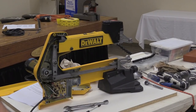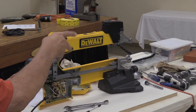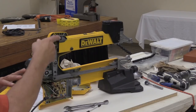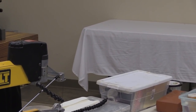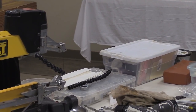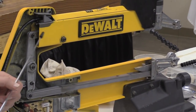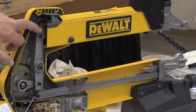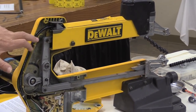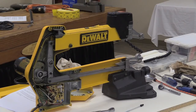How many of you have seen the inside of one of these scroll saws before? Okay, about half the audience. The whole principle of one of these things is that it moves a 5-inch long blade up and down in the front really fast. The way it does that is through a transfer of motion between the rocker assemblies in the front. There are parallel rocker arms up front here and here, and those are driven by two linkages. This one here, and there's another one inside this tube that you can't see, but we will see it before the evening's over. There's also a vertical rocker that takes care of the transfer of motion from the motor, and then these two linkages go back and forth.